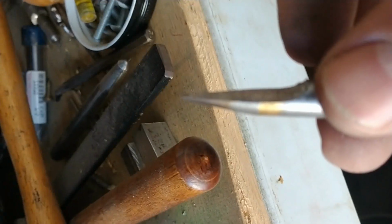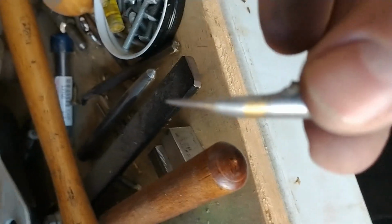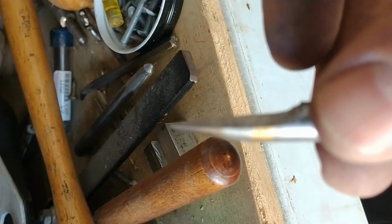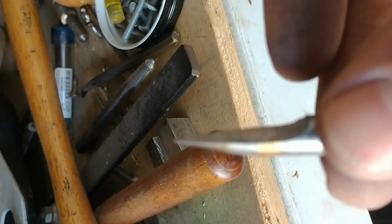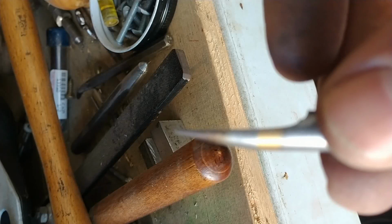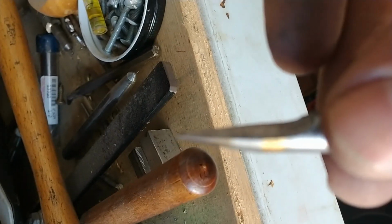I know it's not because there's a little flex in my drill press, and also because my grindstone had a little bit of a radius to it. That's normally why I would have finished up with the diamond stone, is while those tend to have a little bit of run out, their surface essentially stays in the same position, so they're a little more positionally consistent, if that makes sense.